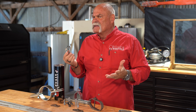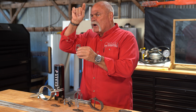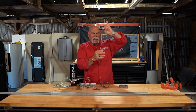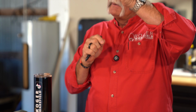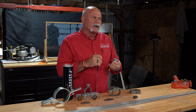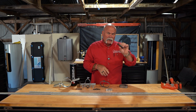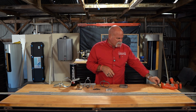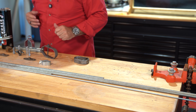But a lot of these things, there's really no way to adjust this unless you're on a ceiling flange and a rod. And then what you're going to do, you're going to look at this bottom inside edge right here, because that's going to be your pipe if this is hanging from above. Now this has got a hole where you could get a 1/4 inch rod in here. So what you want to think about is looking at where your ceiling flange is going to be, and we'll just lean that right over here. We'll say that the edge of this is the ceiling.